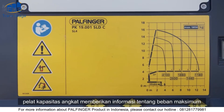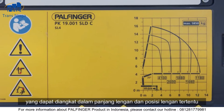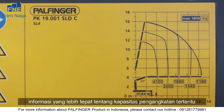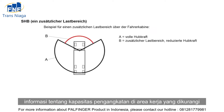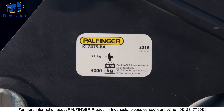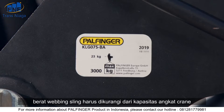The lifting capacity plate provides information on the maximum load which can be lifted in a specific arm length and arm position. More precise information on the lifting capacities can be found in the lifting capacity diagrams in the operating instructions. If the crane is equipped with special lifting options, information about the lifting capacity in reduced working areas or in not fully supported conditions can also be found there. The weight of the rigging must be deducted from the lifting capacity of the crane.